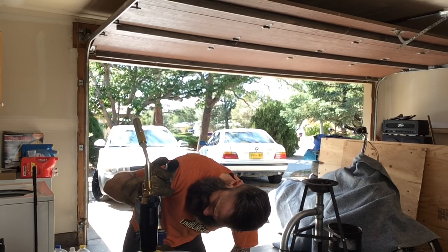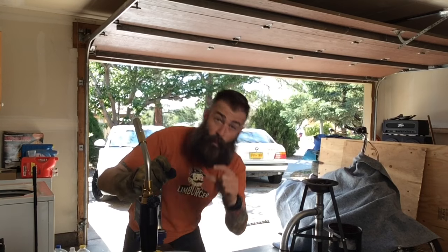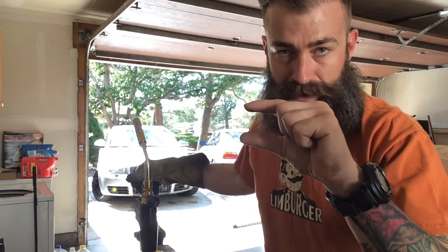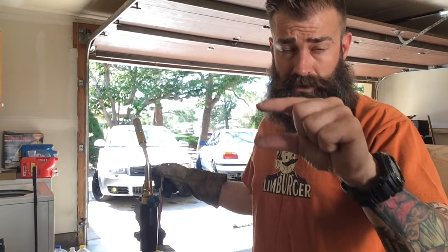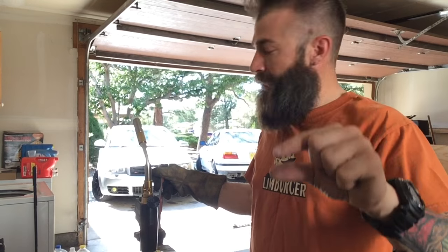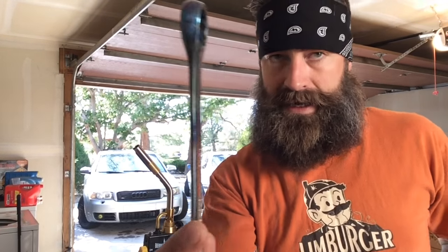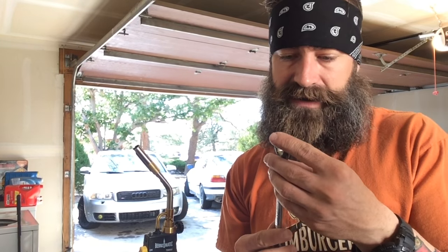So I'm going to overbend it a little bit because what matters to me is that the 1 inch that I'm going to be using outside of the ring is perfectly perpendicular to the thickness of the ring. Okay, I heated it one more time real quick and did some fine tuning on it. It didn't take a lot. It took about maybe 5 minutes total of heating it. It's not super fun because you just have to stand there heating it, but now it's perfectly straight.